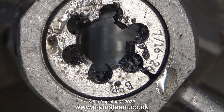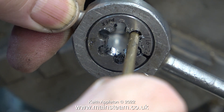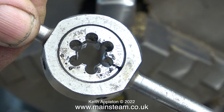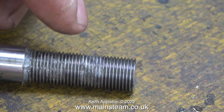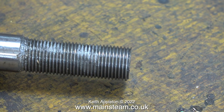Here's the reason, and it's clear for all to see — look in the six circular cutouts in the die. Quite a few of the holes are almost completely full of very sharp and nasty pieces of swarf, which I'm currently poking out with a piece of brass bar. What I really need to do is open the die up as far as possible inside the die holder and re-cut the thread by rotating the chuck by hand, or at least running it a lot slower, stopping and backing it off to clear the swarf frequently — and not forgetting to start with a clean die in the first place. Because the clearance holes in the die were blocked, pieces of swarf started to act as a turning tool and destroy the thread.